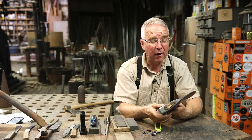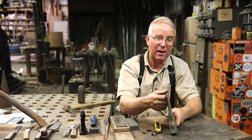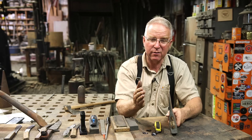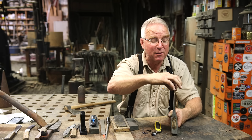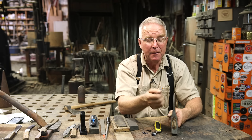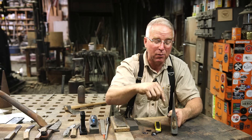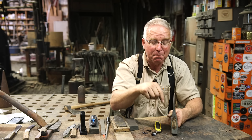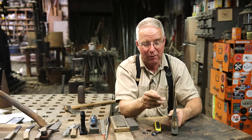Essentially, a gentle wedge with a sharp edge. This has to cut while it withstands a blow. The blow would love to break the edge off, but it can't because it's gaining thickness fast enough that the strength of the material itself, which is increasing as the blow is transmitted back into the axe, is dissipated, is dealt with, is resisted by the strength of the material.